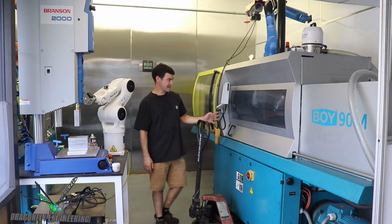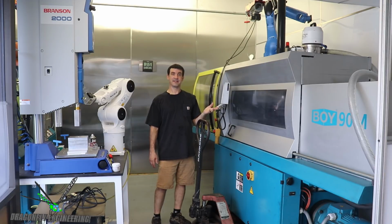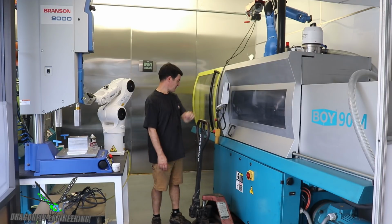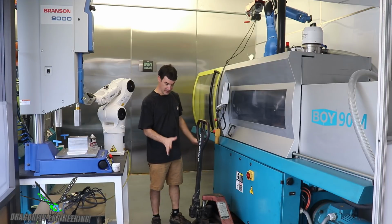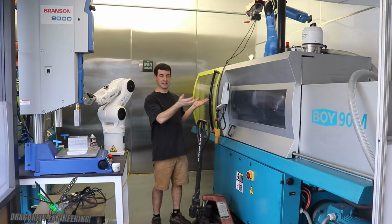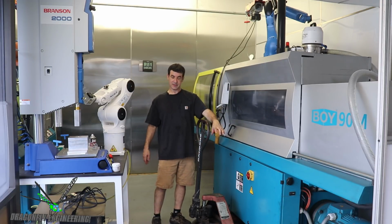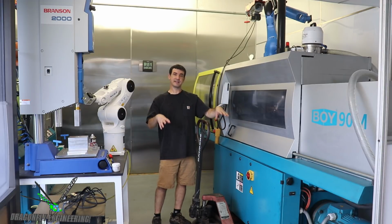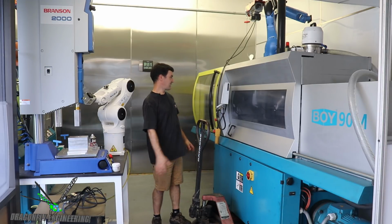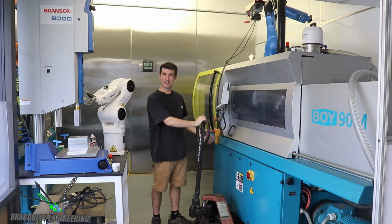This machine weighs, right now with the extra robot and a mold in it, about 7,000 pounds. So I'm going to show you a technique that hopefully works, Egyptian style moving, and I'm going to jack this molding machine up onto these cross tubes. I'll show you here in a second. And then the steel tubes or beams are sitting on these little 1/8" wall steel pipes as rollers. So hopefully I can just move this machine back. It needs to move back about 7 inches or so.